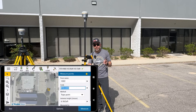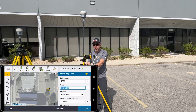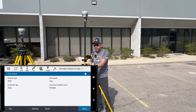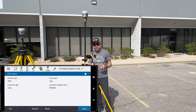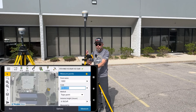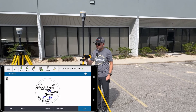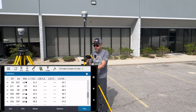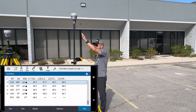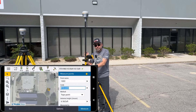In North America, it takes two minutes for fast convergence. After two minutes, it now says RTX plus IMU and I have a green checkbox on the precision statements. Clicking the satellite icon confirms that I have converged on that North American beam. The location of that geostationary satellite depends on your latitude and placement in the United States. Clicking the satellite symbol, you can see RTX showing on the sky plot, and moving over to the list form and scrolling to the bottom — here in Idaho, the RTX satellite is at 158 degrees azimuth and 37 degrees elevation. That's how you use RTX over SV.